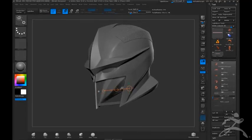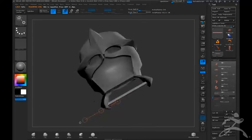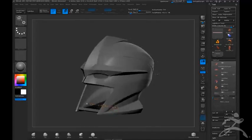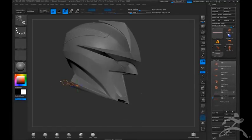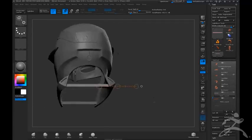So when they go in and cut this off and then have to sand that, it's not going to be visible. Because when the guys in mold get this piece, what they're going to do is actually take some styrene or some clay, and they'll backfill this entire area so that it can be done in a multi-piece mold. So having these set far enough back lets them know how much return you're going to need. So we've already done that one.